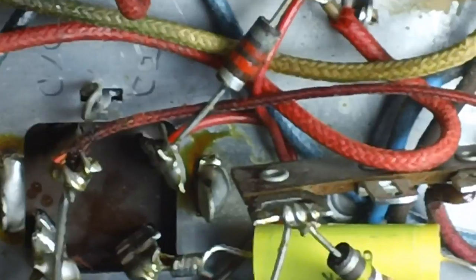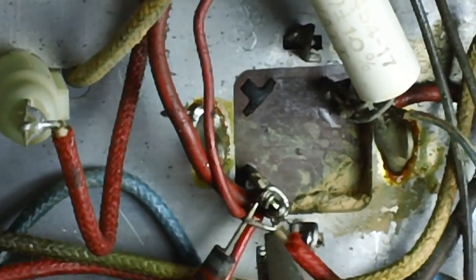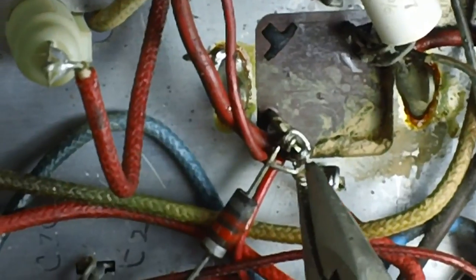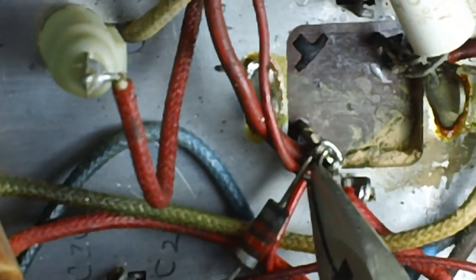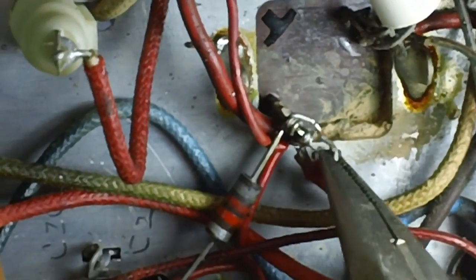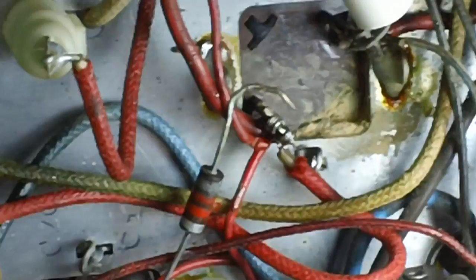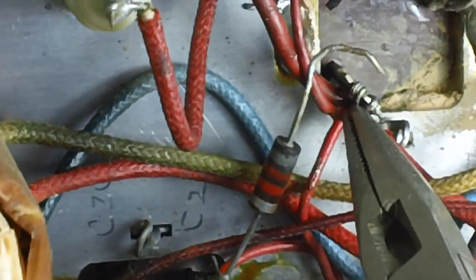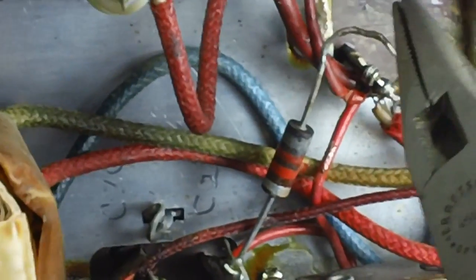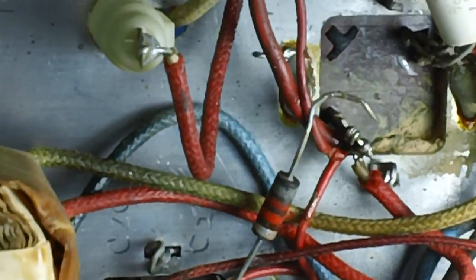Let me get a pair of needle nose here. If this thing worked like it's supposed to, I ought to be able to just peel that thing right off there without any problem at all. Look at that - with that solder gone, was that a piece of cake or not! The same with these leads right here - I may have to do a second extraction because this lead covered those up, but same situation.